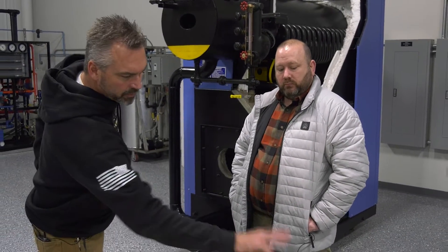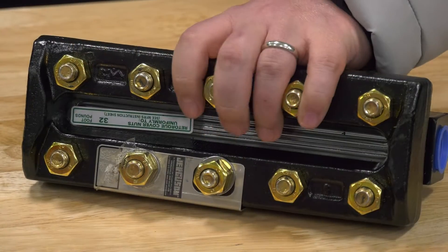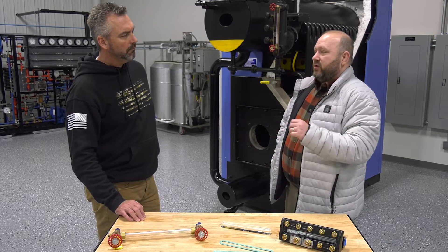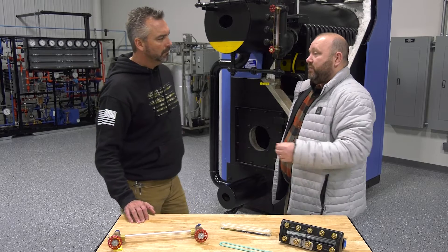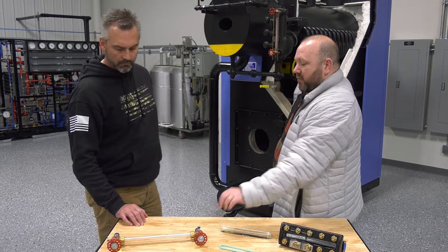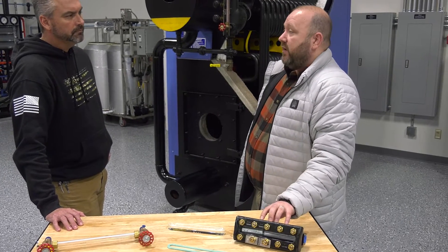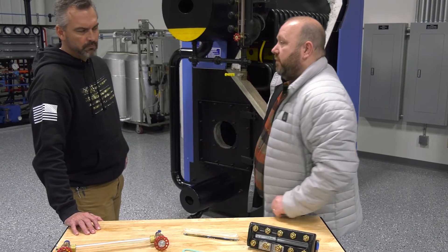Why would we use the heavy duty? Well, the heavy duty is the Cadillac. This is made out of glass, and as you know, in boiler rooms there's a lot of vibration, a lot of temperature, and a lot of industrial-type conditions. Sometimes people can bump into things. So while the red line is the economical version, this is more of a bulletproof type version. They're higher pressure rated — this assembly right here is rated for a thousand pounds, while the economical ones are typically rated for a couple of hundred pounds.